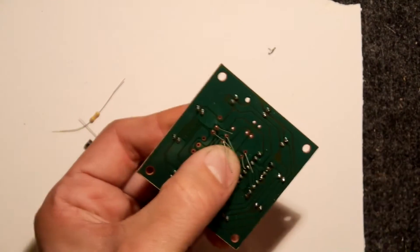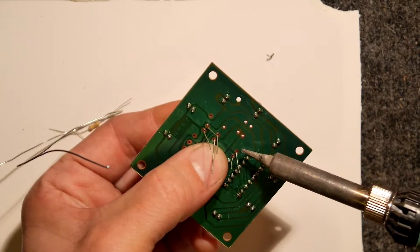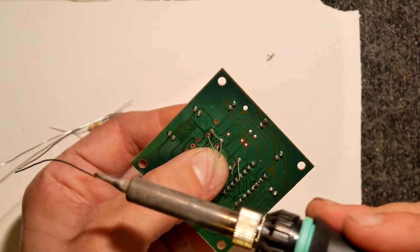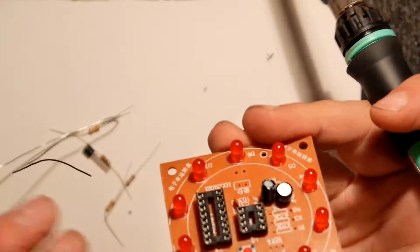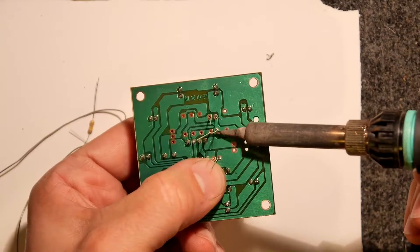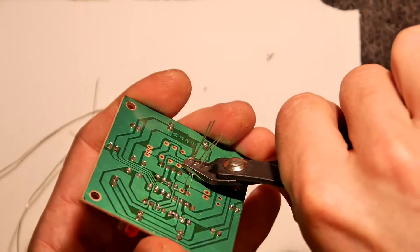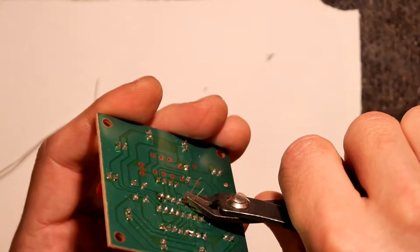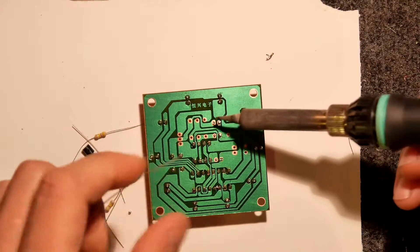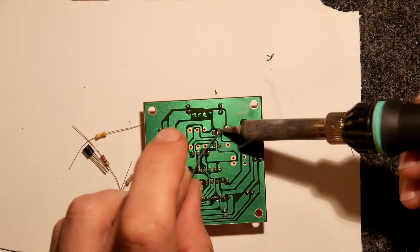It's a bit fiddly doing all three at once as they're all different sizes, but you can see the six legs up there. I'm going to put a blob of solder on the end of my iron and drop that tack bead right in there. The two electrolytics aren't quite sitting right, so I'm putting my finger on them just like with the LEDs to get them home - they jumped right into place. Side cutters to trim them off. You don't need millimeter accuracy - just trim them to the top of the tack blob, which is actually a good guide. Retouching them up - we're almost there.